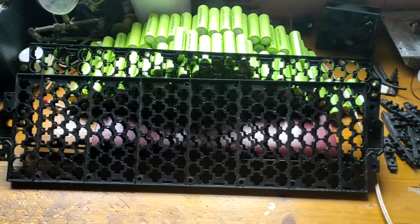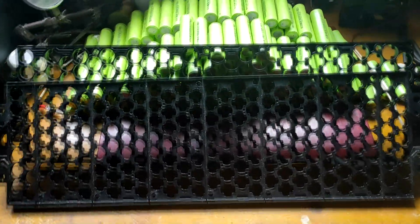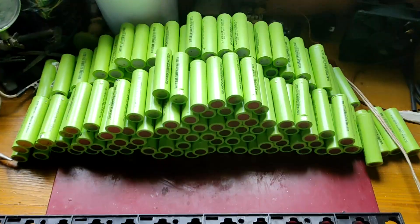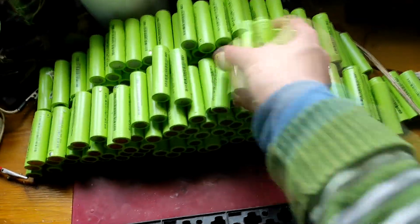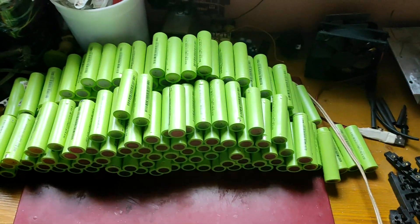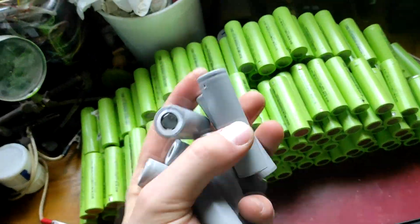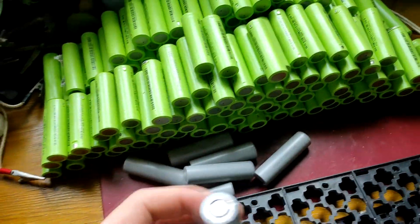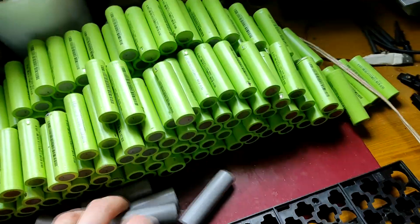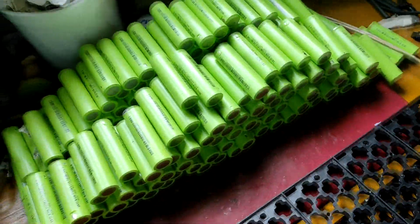The pack has been disassembled. You might wonder why — the layout of the cells was not correct for my desired application. I've never seen so many 18650s in my life until now — today's gold basically. There's also something funny: these are placeholder cells. They're completely empty, super lightweight, just shorted — for pack stability, nothing else. I've never seen that before.